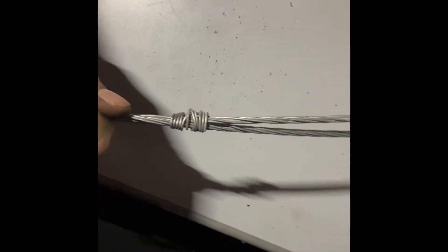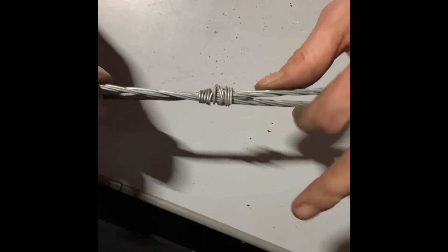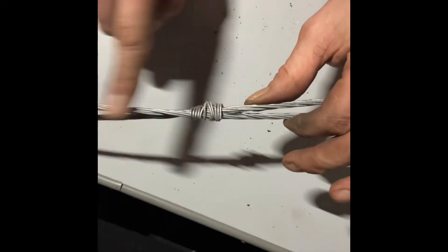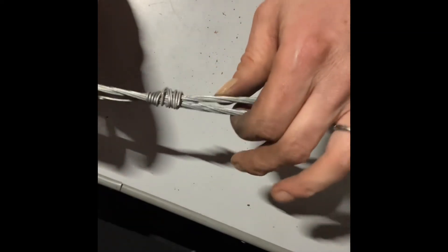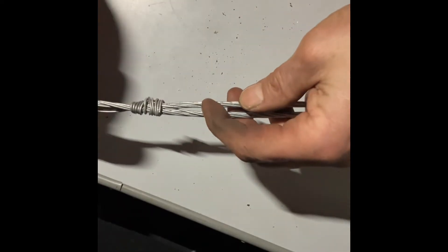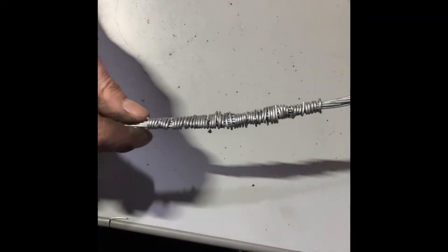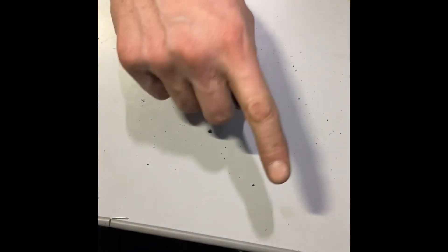Get the opposite piece of wire, take a twisted strand off that. When you're untwisting these they're a bit awkward to start with but once you've got it off it's fine. Take it all the way back to your joint — don't start here because that won't work. Pull it as tight as you can. Do the wraps — five, six, seven — cut it and make it neat. There's a little gap but these will pull tight together. Keep them as tight as you can and continue with all of these until you get to the last strand.